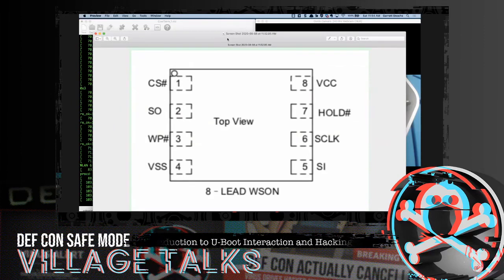We never destroyed the chip, but during the attack, even though I was taking the data line down to ground, I ended up actually damaging the U-Boot so that the chip would not boot up anymore. It would come up giving you an error in the U-Boot. How it altered part of the data in the U-Boot during this process, I have no clue. Maybe it did fry a register in there or smoke something. But we were able to pull the chip and then successfully pull the entire operating system off and recover it all anyway.